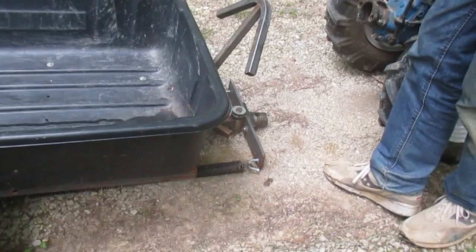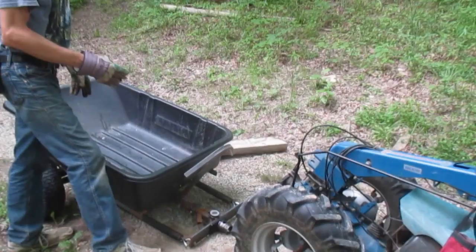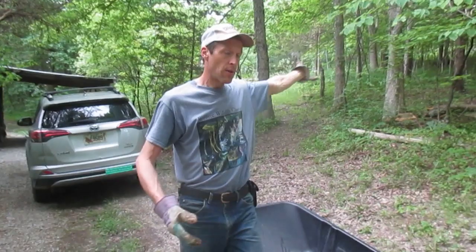This is similar to our utility trailers. That is, all the towed utility trailers that you use behind a walk-behind tractor swivel on a clevis hitch here. And usually you're sitting on those trailers and driving it with the handlebars. Well, that's fine for a lot of applications, but it also makes for a pretty long rig, because you've got the tractor, you've got the operator sitting in the middle, and then the utility trailer behind. So the turning radius is fairly large and needs some space to maneuver.